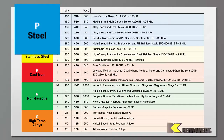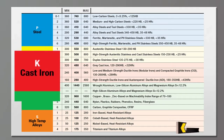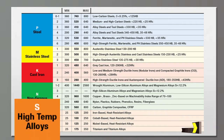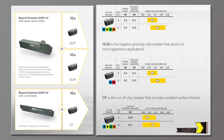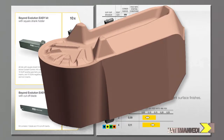Lee, there's a range of grades that covers a broad spectrum of material to be machined, from steel, stainless, cast iron, non-ferrous and super alloys, and in some cases hardened material as well. Also available in square with varying corner radii as well as full radii for profiling and other radii-type grooving applications.